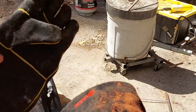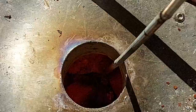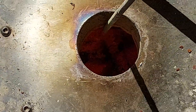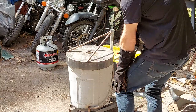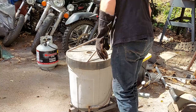Since we're doing some lost foam I've got the respirator, the gloves, and a decent face mask so if we get any splash back we're covered. You can see down inside we're actually getting pretty hot — above a thousand degrees Fahrenheit. You can see it getting a little crumbly; it'll start melting soon. The scrap parts I'm melting down are A356 aluminum from a Chevrolet rear subframe cross member — just some recycling — and it's always fun to watch them melt down into a liquid puddle.